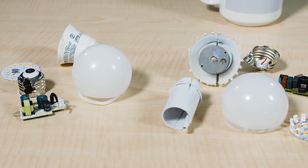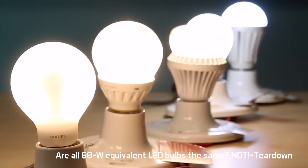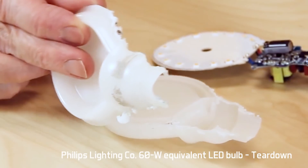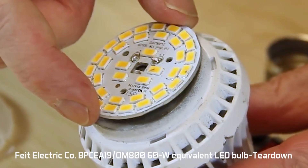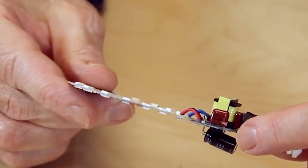If you tore down an LED bulb manufactured a few years ago, you'd likely find evidence of hand soldering and some kludgy design practices. We found both when we examined LED bulbs back in 2015. We took bulbs from several manufacturers that all received the highest rankings from Consumer Reports. Several were loaded with potting material that served to add stability to the screw threads and help manage thermal dissipation. A number of the mass-produced bulbs used hand soldering, most typically in making a connection between the LED plate and the circuit board. In 2015, it was also common to see bulbs carrying sizable heat sinks, and the circuitry driving the LEDs tended to be comprised of at least a dozen discrete components placed around the LED driver IC.